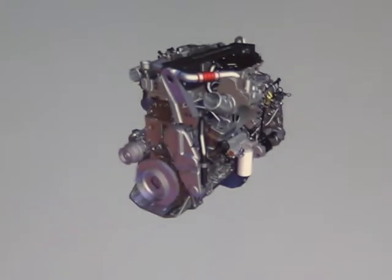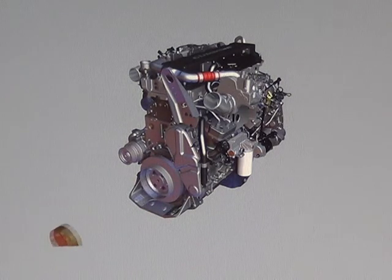The viscous vibration damper and pulley mount to the front of the crankshaft. A drive adapter or mounting plate provides the ability to bar the engine from the square drive. If the engine is equipped with a drive adapter, a front PTO can be used.